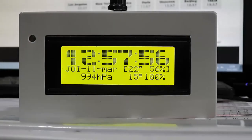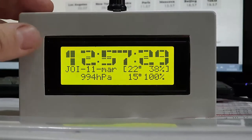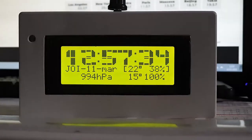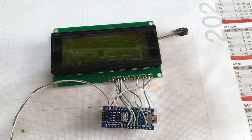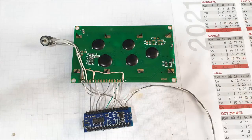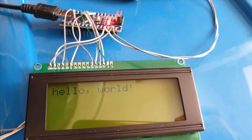The photoresistor enables you to auto-adjust the brightness of the screen according to ambient light. This is done by connecting the backlight of the LCD to a pin of the Arduino, which then powers the backlight with PWM. The construction started by connecting the parallel LCD to the Arduino, not using the I2C 2-wire interface, then testing the LCD and adjusting the brightness and backlighting with PWM.